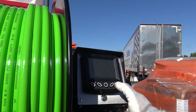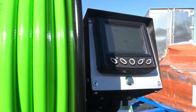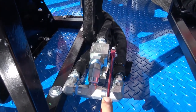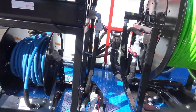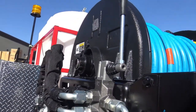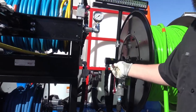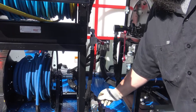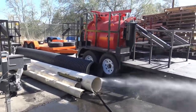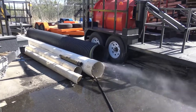Chris is working on the startup, pushing the button — shows the RPM. We're going to let this unit warm up just a little bit. This is the start-up position: easy start valve, hose reel off, hose reel off. This unit also has dual hydraulic control — this is the 3/8-inch reel, half-inch reel. We're in the pipe, going to give this thing a little juice and turn on the water flow. Turn on the unit — we've got a little spray going on there, a little rotation action. That's on idle; we're going to go ahead and wrap it up a little bit.